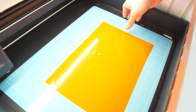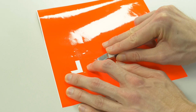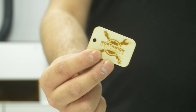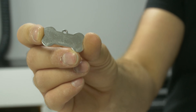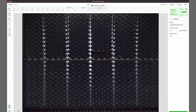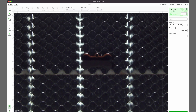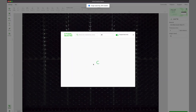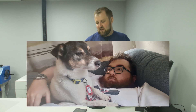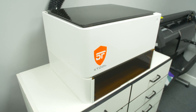That's all done — we'll get it out, peel the sticker off the backing with a scalpel, and stick it on the machine just like that. Not only can it do wooden dog tags, it can also do metal ones — one of these came in a little kit. Same method: put it on the bed under the red dot, but be aware it shows up a little darker so you do have to squint to see it. Change the setting over to dog tag engraved. This one is for cameraman Matt — his dog's called Ty — so we put 'Ty' in standard font, click engrave, and that's the result.